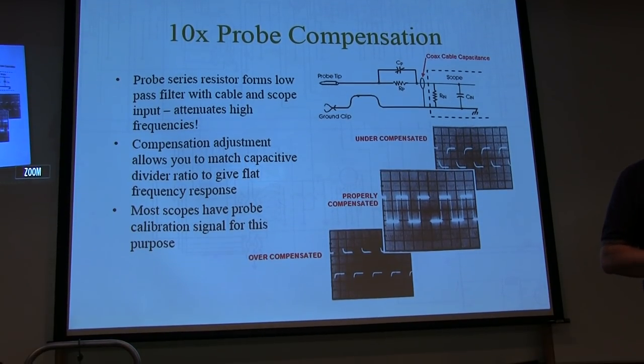Anybody got a metal screwdriver here? Show them what it does to that waveform when you touch the trimmer. Yeah, I don't have one. Yeah, put it on the trimmer and the waveform goes wide. It goes totally silent. You tune it with that, and then you take the screwdriver away and it's back to running.